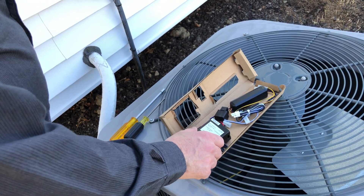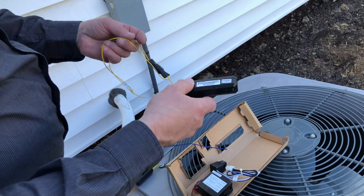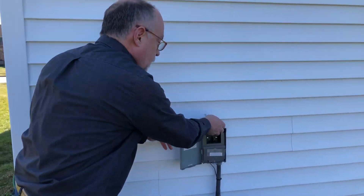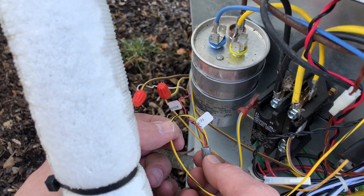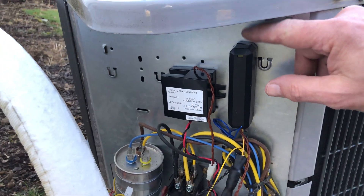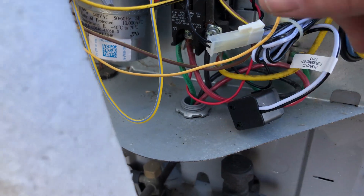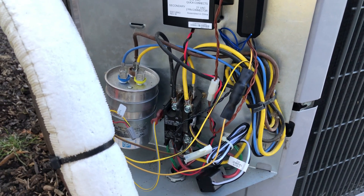The outside kit contains a transformer — this is a 240 volt one we're going to tie in for the air conditioner — a CT, and then the communication set for the outdoor unit. First thing, pull your power so you're not working on anything hot. The really important thing to remember when wiring the outdoor section is that red wire we disconnected inside that was connected to the black tracer — you want to connect to the black tracer out here too. This way this wire acts as a comm wire from inside to outside. I've got my outdoor transmitter hooked up and transformer hooked up. Make sure you connect the transformer to the incoming power — not on the contact side, otherwise it won't have power all the time and it won't work. Pretty simple indoor-outdoor installation — took all of about three minutes.